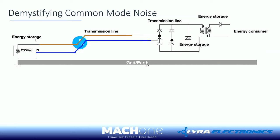I'm using a very simple design, a design we see every day in our daily life. You have mains voltage coming in, connected to a charger. So this is your GaN-driven, say, phone charger or a laptop charger, 65 watts or 130 watts, whatever the power rating is. Often an active clamp flyback is used in this case. It's a simple circuit: you have 230 volts in, 400 volts on the DC link, and then 12 or 24 volts, whatever, to charge or drive an LED.